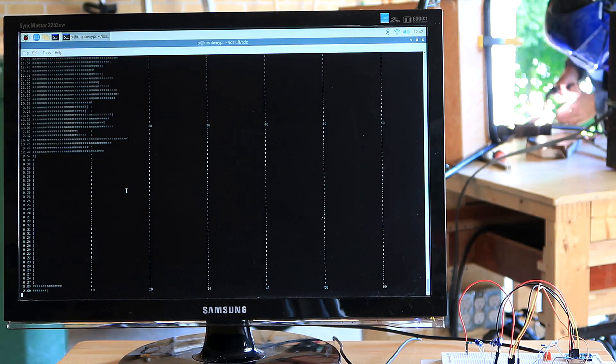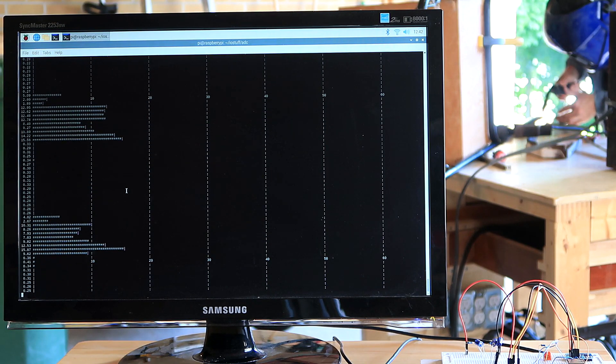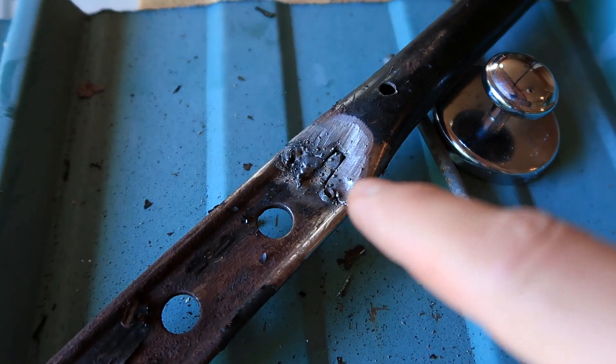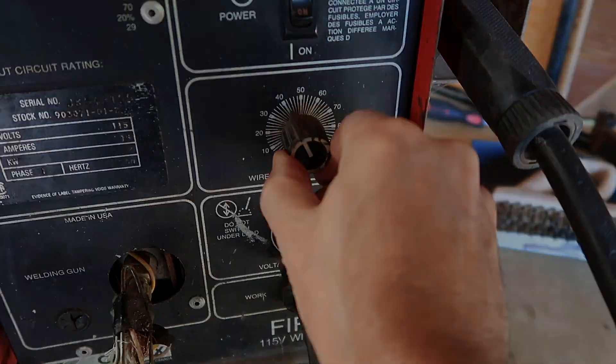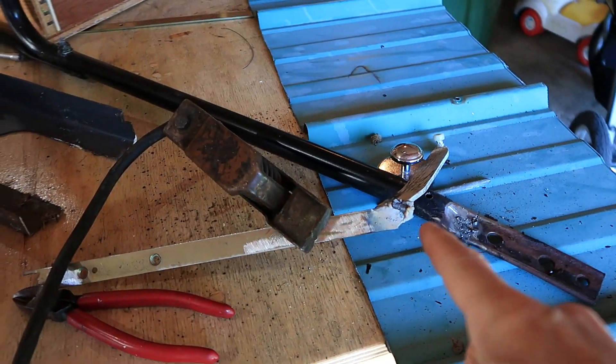I did blow through the metal, so I'm just welding in small pulses and letting it cool in between to fill that hole. That's my awful handiwork — I welded right through it. So that setting is a bit too much for this job. Well, I got that handle welded back together, but now I'm curious — here's some scrap metal, I'll go maximum.